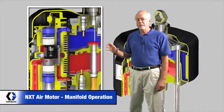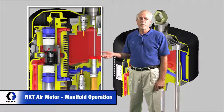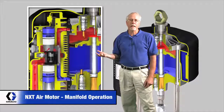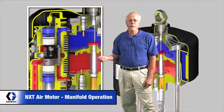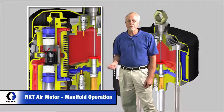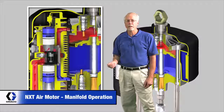This magnet and the sensor read each other to determine where it is, where it's positioned. With that, we can take the input and analyze that information to see how fast it's going, see how many strokes it's taking, and different pieces like that. The linear sensor gives us a lot of advantages on this motor. You can get it with or without the sensor — it's actually a little bit bigger.